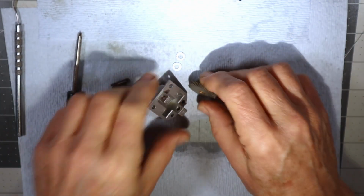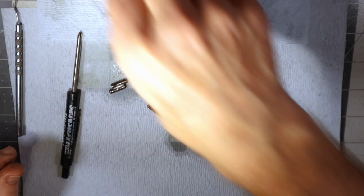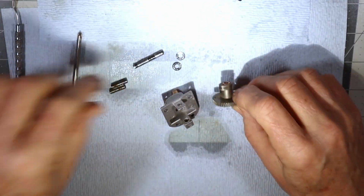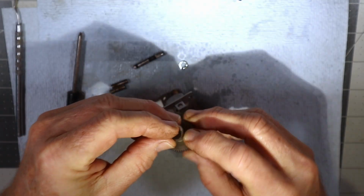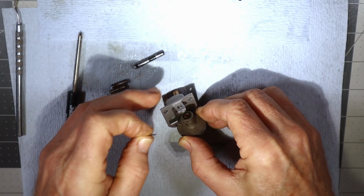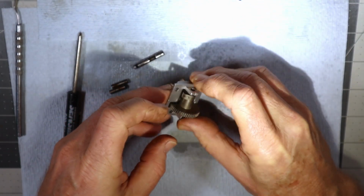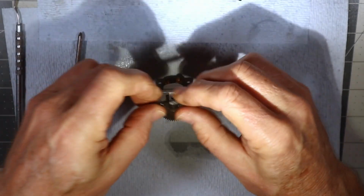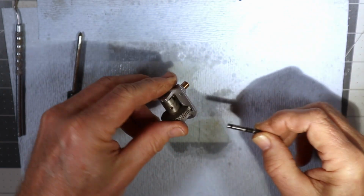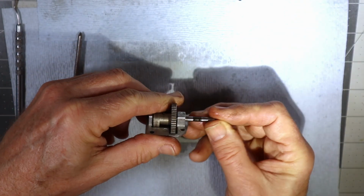So what I've got to do first here is give all those things a little bit of a squirt. I need my center shaft too. And these little, in the ancient past, these things were Teflon discs. Now they're metal. Now this has an orientation mark or a cutout in it so that it goes in this side like this, and that set screw holds it in place.